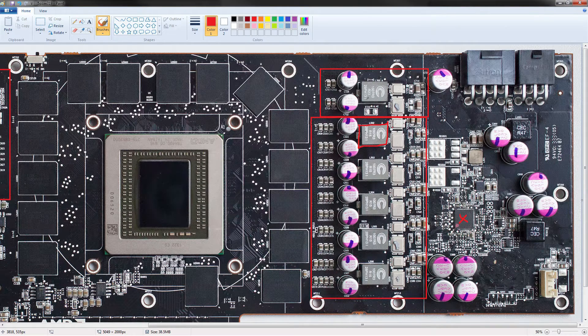For MOSFETs, the VRM is fully loaded — everything on this VRM is IR. The voltage controller is an IR3567B. The MOSFETs are also IR. The small ones right here are the high side FET — that's an IR6811. The IR6811 is a relatively low-power MOSFET; it does 32 amps at 125 degrees. This is what feeds the VRM with 12 volts, so it doesn't need to be super high current. 32 amps gives you 360 watts at 125 degrees. You really should keep this VRM cool because the IR3567B has thermal protection — if these VRMs go over around 110 degrees, they start to throttle the GPU core clocks.